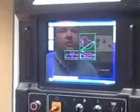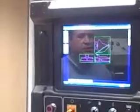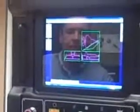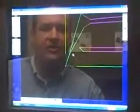I cut out my 2-inch by 2-inch block ahead of time and need to make sure that we have the block accounted for. And so what I did was I redrew my actual measurements of that block after it was cut into this so that I could determine how the starting traverse is going to line up with the bottom left corner of each of these cuts.